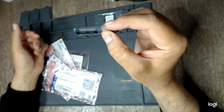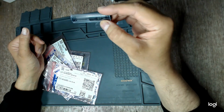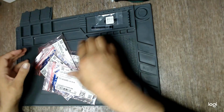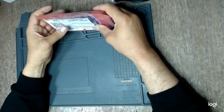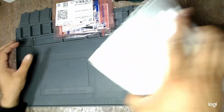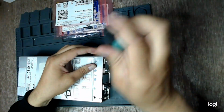And I will also need to replace the PFC controller IC. Tony asked me to do that no matter what the one on the board does, just to make sure. So yeah, we will get to do some soldering, and I will do it under the microscope just for the fun of it. But before that, I want to check something. So let's open the power supply again.